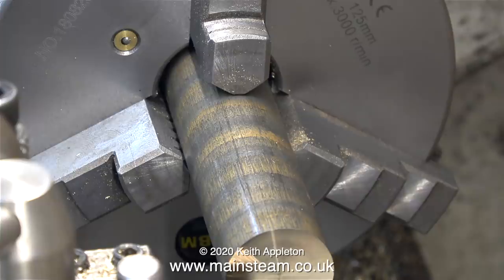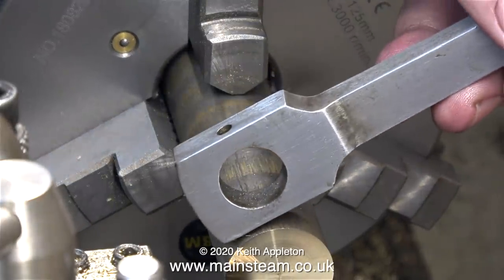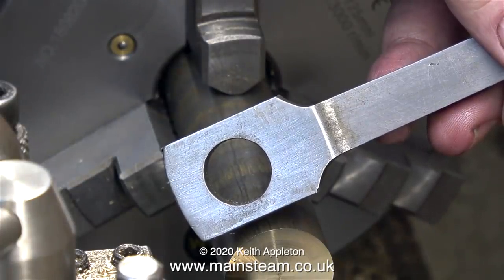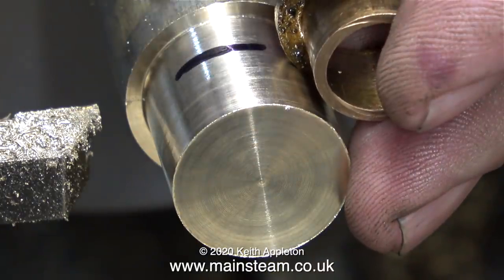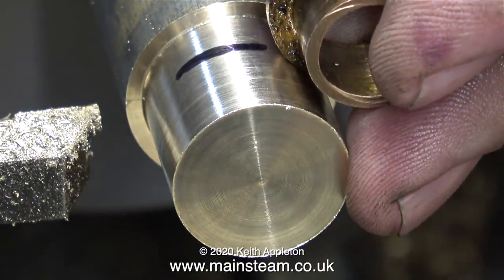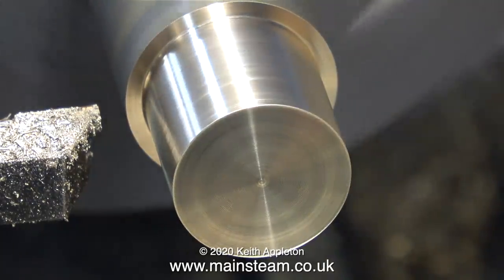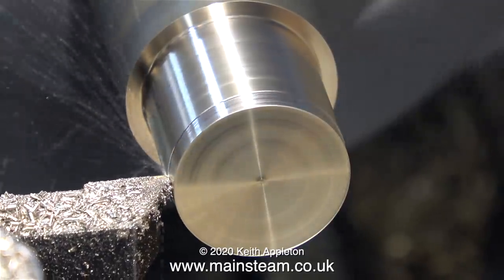When I went over to Black Gates Engineering last week I bought some phosphor bronze — this is actually leaded bronze. The red stuff is really horrible to machine and it doesn't seem to wear any better or worse than this does. I'm about to make a new bush to fit into the hole in the connecting rod. The first thing to do was to turn down the outer diameter to the same as the original bush. I marked it with a felt-tip pen so I know how far to go when I turn down the inner diameter that fits in the connecting rod.